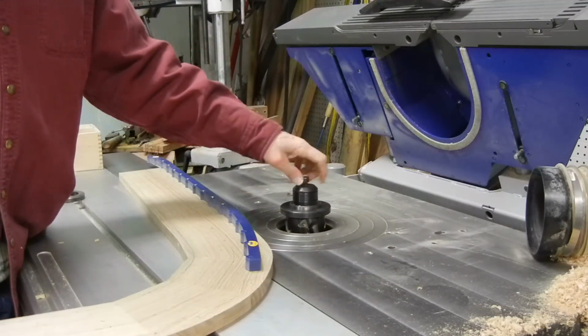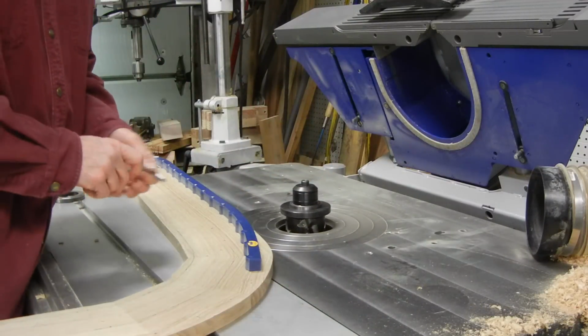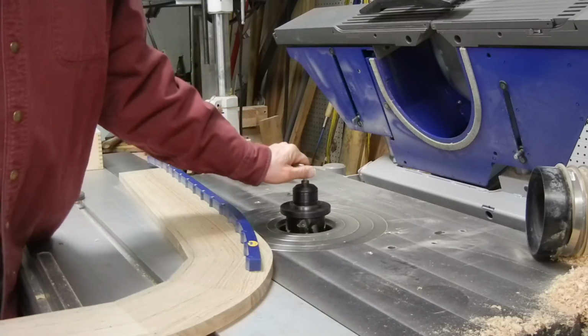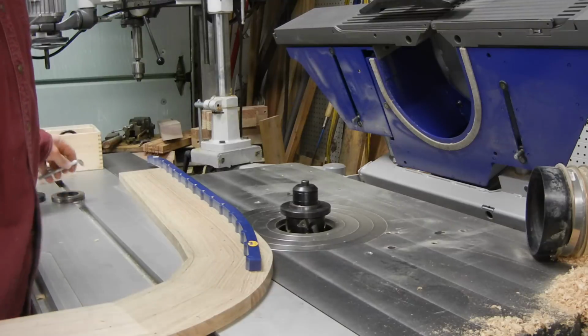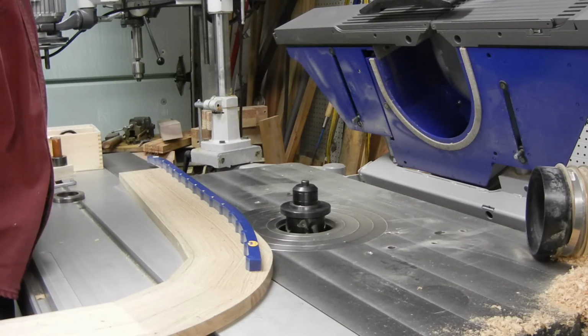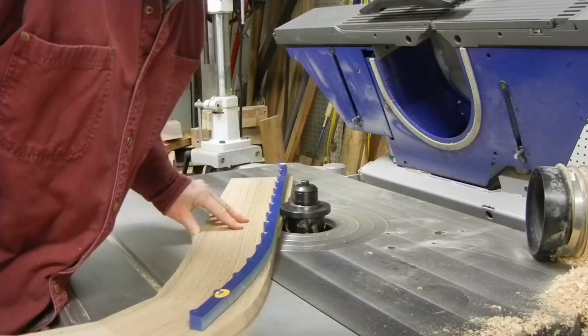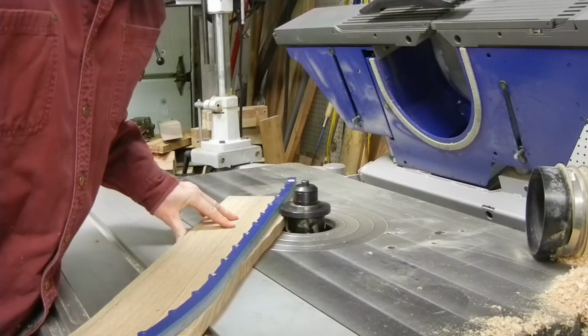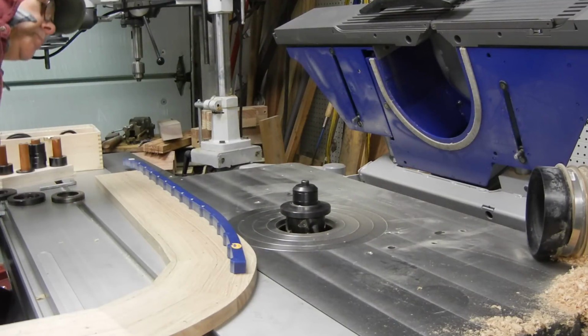This is running at 10,000 RPM on a 30 millimeter spindle. These are three-edge carbide knives, so you can rotate those if you think you're getting a little dull. So that's how it's going to come up here at first. Unlock the spindle.